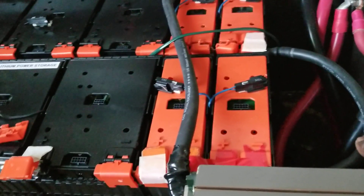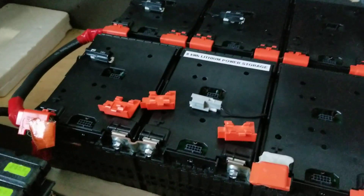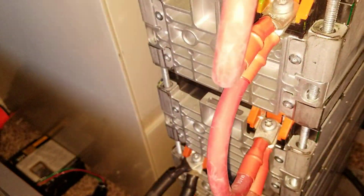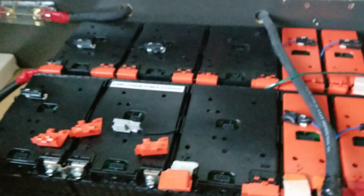What I did was make sure all the parallel wires are the same length. I don't like when they aren't equal length because you get uneven loading on the terminals. These are two-ought cable — you can see it's a big cable. That's how I interconnected them. I want to do the same thing here with a bigger cable for the interconnect, which parallels the batteries together. I want to upgrade it to a number one cable going forward.